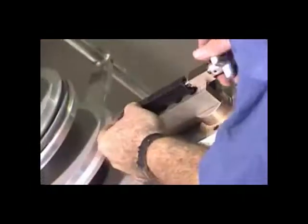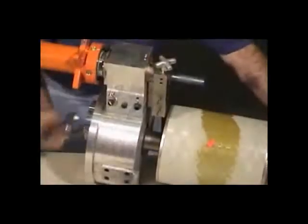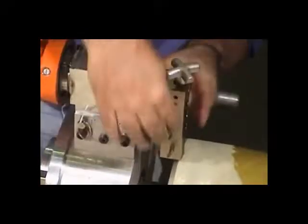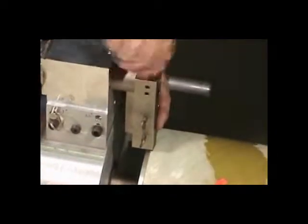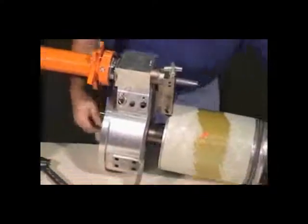The insert holder is very similar in appearance to the cutting insert blade. Put the factory taper gauge onto the mandrel as a guide to adjust the tool setting to factory dimensions. Tighten the mandrels with a mandrel nut. Advance the cutting head over the factory taper. Loosen the thumb screws and turn the feed knob to move the cutting head down until it makes light contact with the factory taper. Tighten the thumb screws at the bottom of the cutting head insert. Loosen the mandrels and remove the gauge.